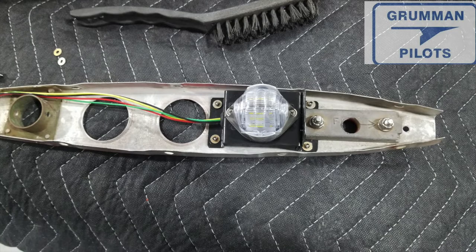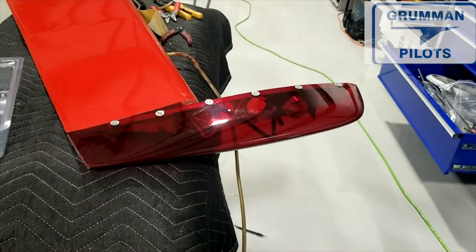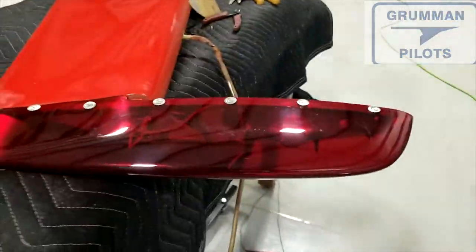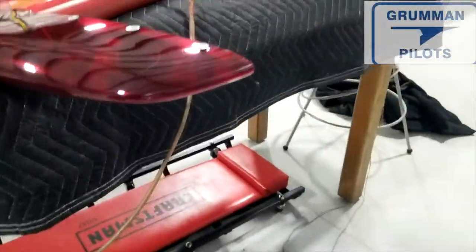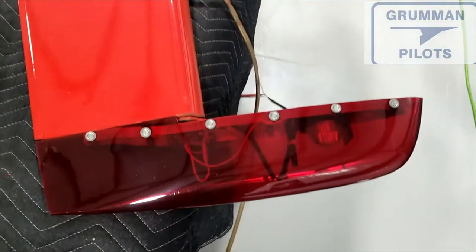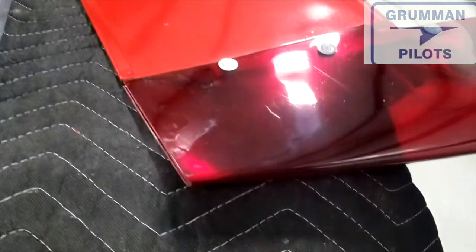The project started because we wanted to put an Arrow LED Sun tail beacon up on the tail under the red rudder cap. It is a very bright strobe and it draws a lot less current than the original Arrow flash. Here it is working — we don't have everything finally finished yet because it hasn't been balanced yet, but we just wanted to check the operation and see how it looked. It is much brighter than the original Arrow flash LED.